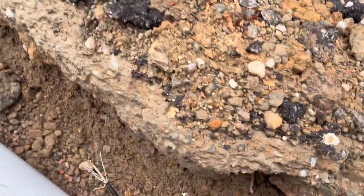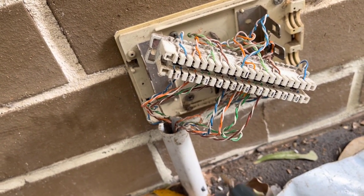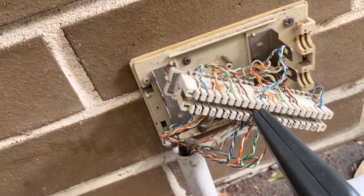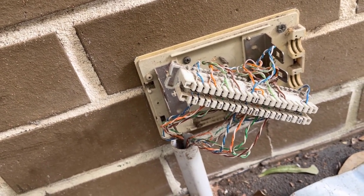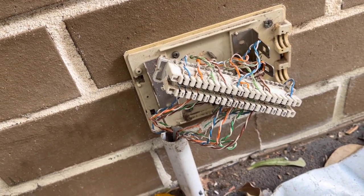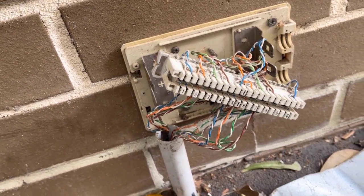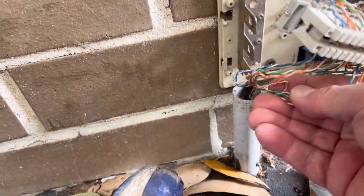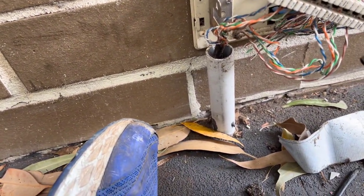Not entirely unexpected, but this one is wired differently again - it's blue, orange, green, brown - the correct way, starting at number five. What I'm going to do is take one cable at a time to make life easy. I'm going to snip these off here too, because that's coming out of this cable here.